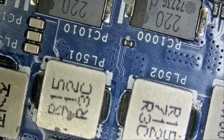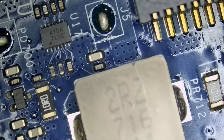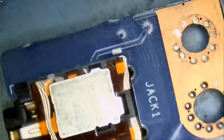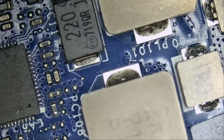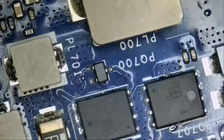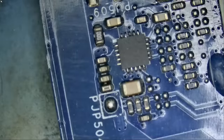The first thing I do when working on laptops is I check the DC connector and DC power MOSFETs. I start from there, or sometimes I do a visual inspection. Sometimes we're able to figure out the problem by just doing visual inspection — maybe we have a burnt component, a knocked-off component, a discolored component, corrosion. You can tell a lot by doing visual inspection.